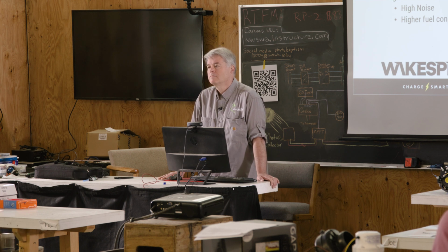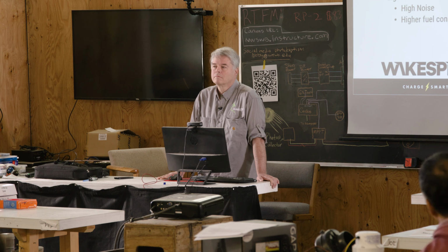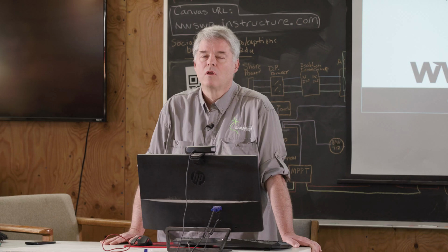Where I'm sensing you're headed with this is that when given a choice in a marine application with high loads, a lot of systems, a lot of demand, between a generator and all of its maintenance and all of its engineered-in limitations, the higher capacity DC system is preferred.